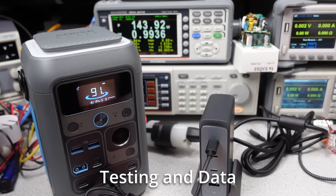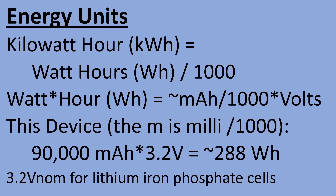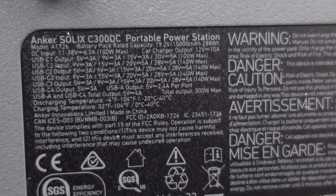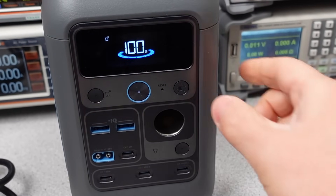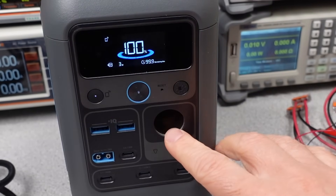So what is energy and what do the numbers mean? The battery capacity is rated a few different ways. One way is the milliamp hours or amp hours, which is an adjusted value for one cell voltage of the battery pack — it doesn't mean much of anything. 90,000 milliamp hours in this case. This times the battery voltage of 3.2 volts for lithium iron phosphate cells gives you 288 watt hours. Now this is useful — this is the energy the device is storing. You can always use this number to calculate the runtime for the power bank: 288 watt hours divided by how much power you need leaves you with hours. What's nice is this device does the math for you and gives you the result with losses on the display, and it's accurate.